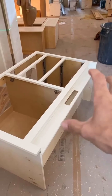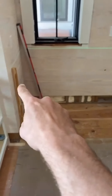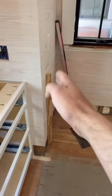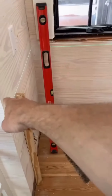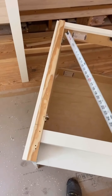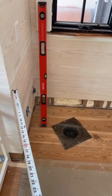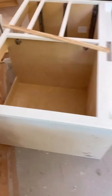We've got basically a wall-to-wall cabinet — sitting tight to that one and tight here. Since we can't take our cabinet and just set it in place, we have to create a template to scribe this to the wall. We screw a little board on here temporarily so that it's plumb, scribe that to the wall, then pull it off and shave down our little template piece to match. I measured from here to here and ended up with 55 and 13/16. Measured at the bottom: 55 and 11/16. From the top of the cabinet, measure over 55 and 13/16, then 55 and 11/16 — put your tick marks and transfer your template. Now we'll track saw, planer, the whole deal.